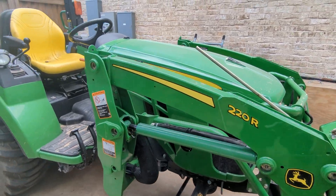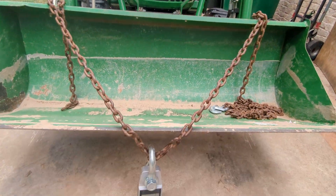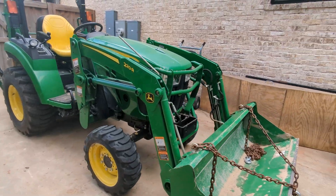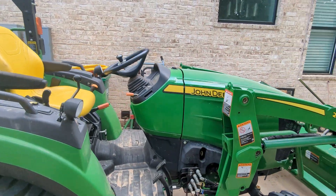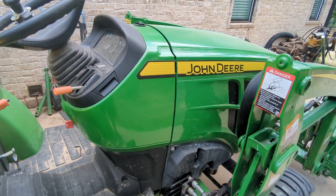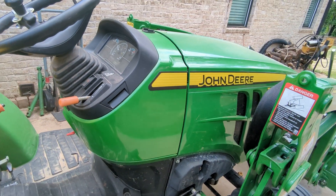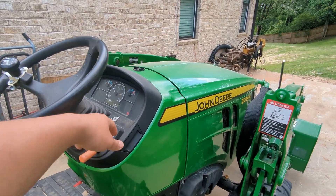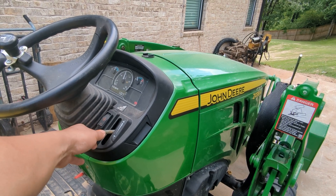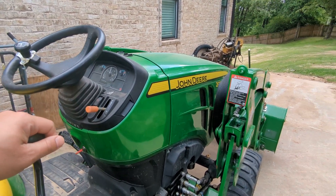I'm not going to change pressures. The pressure at this one is around 3000 PSI. Let me get my peak reading set. The first time I did this, I did not set it on peak and I kept moving back and forth and didn't do much — I had to guess at it and use two cameras. Not going to do that today. The tractor is somewhat warmed up — the engine is warmed up; not sure about the hydraulics. We'll do two pulls. Start with 1500 RPM.